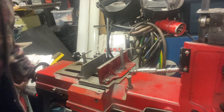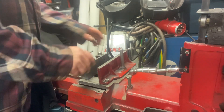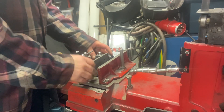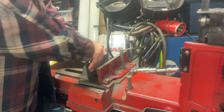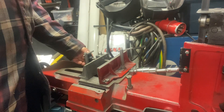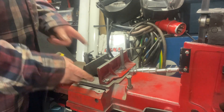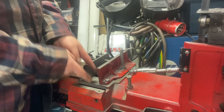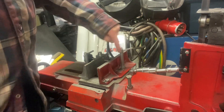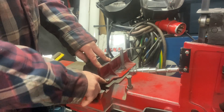A quick view of the quick release: if I had a piece of short stock in there that I needed to cut — even though this is locked, it's not brilliant because with the force on it it would still move — I would then push down the lever, push this through, screw it up to the right size, and then I can clamp the shorter piece in this side of the jaw without the jaw releasing and letting it go.